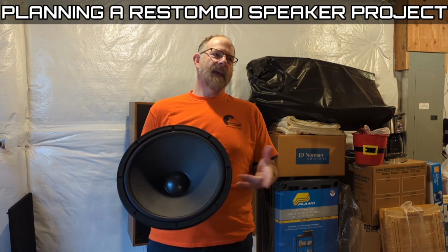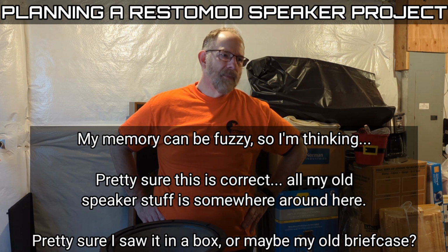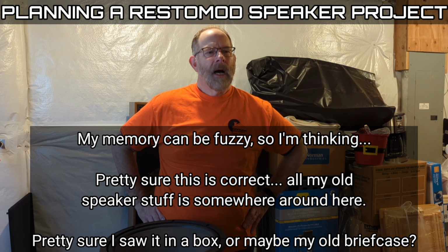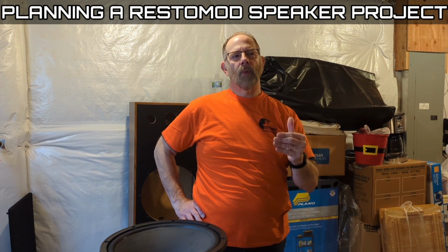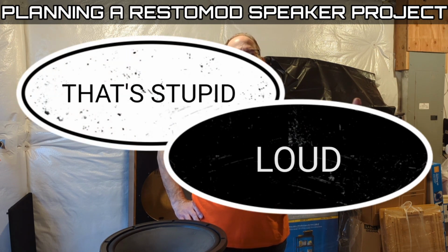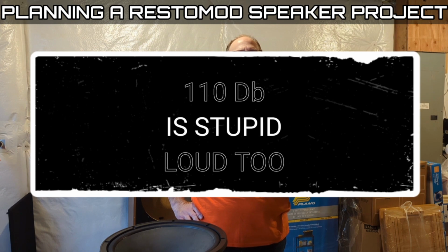So the best results I got was, I want to say, a frequency range of about 17,000 to maybe probably about 27 to 29 on the low end, and that was over that entire space. Within the first 25 feet I measured, I could get about 129 dB. Further out, about 50 feet, that dropped considerably to about 110, somewhere in that area.